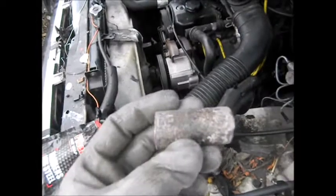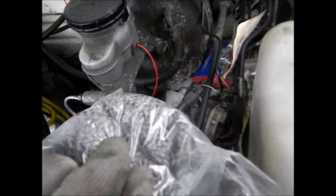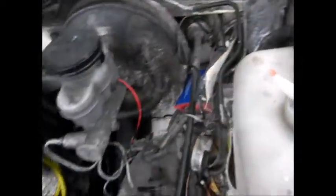What I did initially is I had this sleeve that I put over it and put in between it. Then I wrapped like a tin can over it. Then I put the hose clamps over it. And then I stuffed the ends with fiberglass — I had some fiberglass rope. I've seen people do this. It's basically a stove fix: you get the stove cement and you get the fiberglass seal for the stove, and you mix it all together and put it in there.